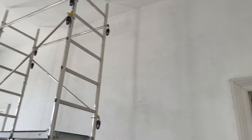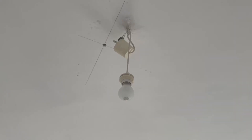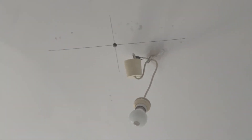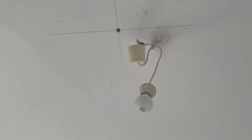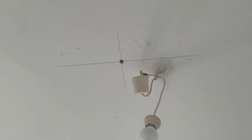So we're now in the BB room, and above my head here is where we're going to hang the chandelier. You can see above me — X marks the spot where the centre of the room is, as I said upstairs in the attic. We're now on level one floor. We'll be running an HR cable to here, then going through the ceiling above, running a cable down to the switch on the wall.